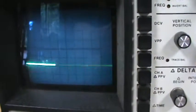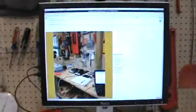Basically, I see the 4-byte commands one after the next, and they're well formed. They're still completely together, but no replies are coming back. Now, I think that they are coming back, but it's so rare. It's very, very inconsistent. The reason I think that it does work occasionally is if I pull up the software, I have seen the light come alive.